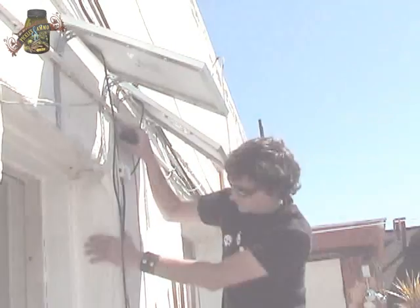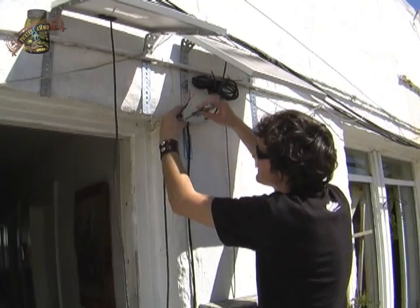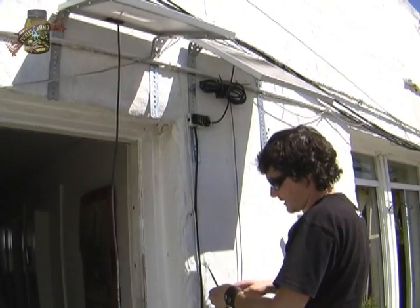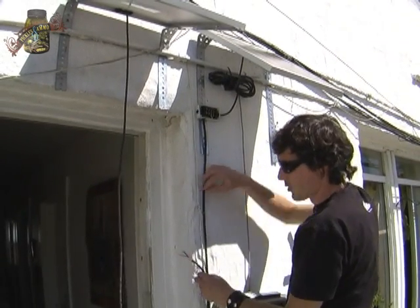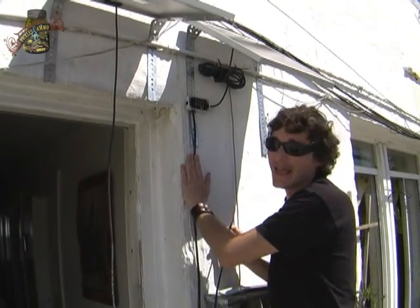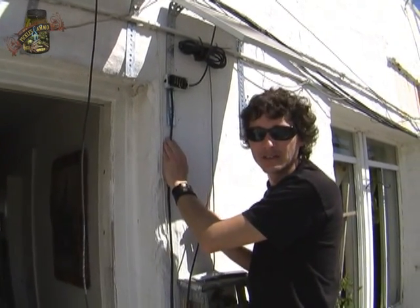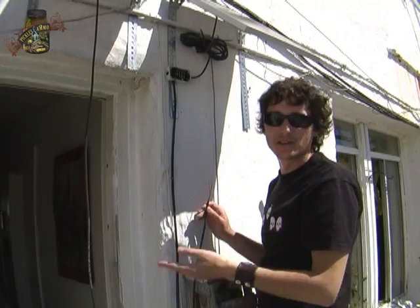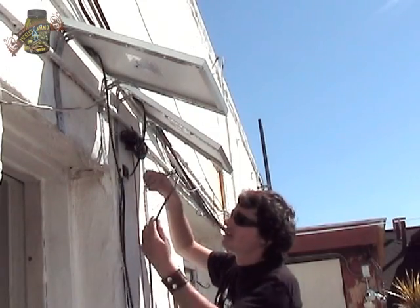Let's take a look at our wiring. What I've done is built a little junction box here. What this does is take the two leads from the solar panels and merge them into one lead that goes to our charge controller. This wire I found at a local electronics store — you want to get wire rated for as many amps as you can reasonably get. This is 16 by 2, or I think AWG 12 is the number. We'll go through all this stuff on our website, picklesandammo.com, where we've got forums which may be helpful if you have a bizarre situation. Pretty good place for information resources.